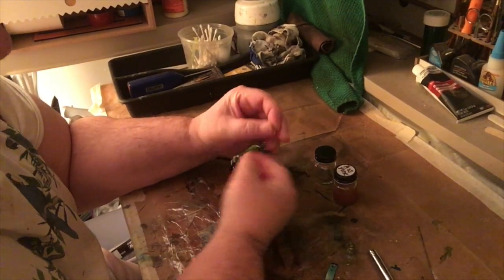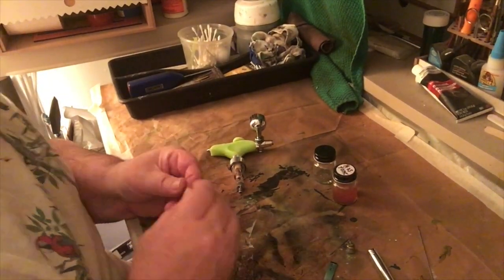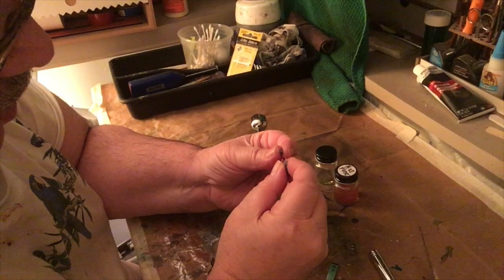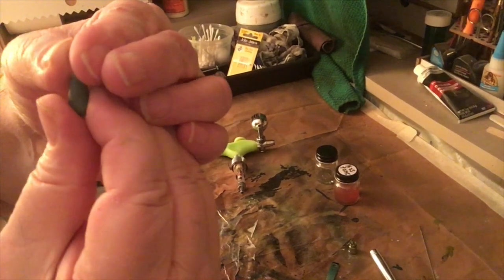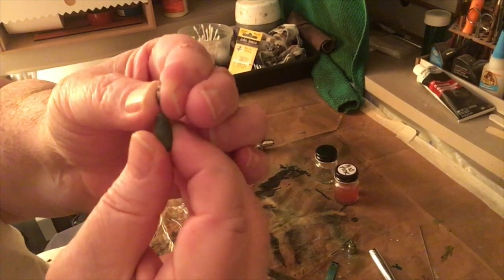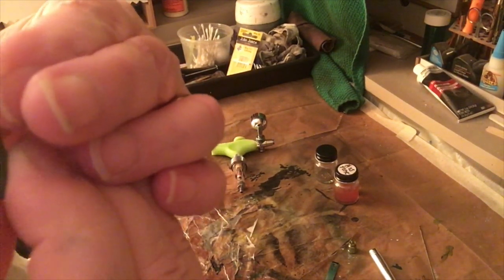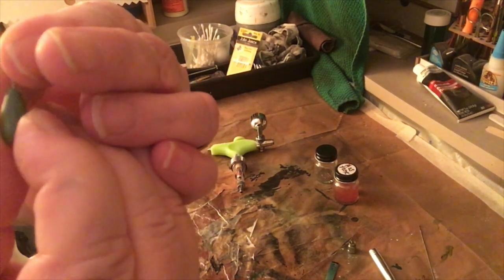After you pull it out, you take this tool that we made in the previous video, I believe it's a size 11, and you go in there and clean inside, and go right through and clean the crud out. You can almost feel it in there. And you'll see brown stuff come out. See how it comes out the tip? Moving it back and forth, you want to get all that crud out.